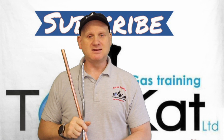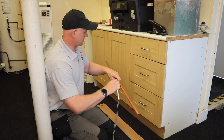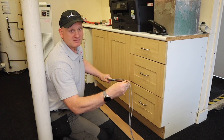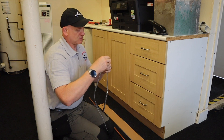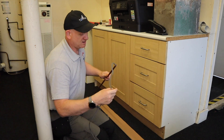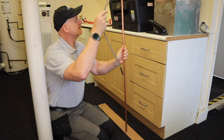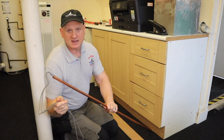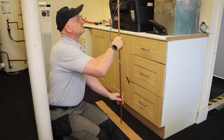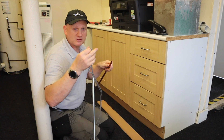Let's have a go at bending a 90 degree bend the correct way. How do we get the spring down into the pipe? If I were to measure it in the middle and bend it in the middle, I put the centre of the spring into the centre of my mark, get the wire to the end of the pipe and bend the wire over. If I slide that down into the pipe and it won't push in easily, all you have to do is either stand it up and knock it onto a piece of wood, or tap it on the wall and it will go down to your mark. And if you want to pull it out, it just pulls out with the wire.